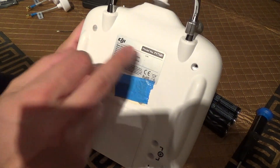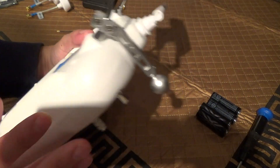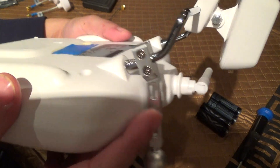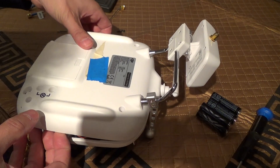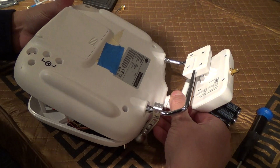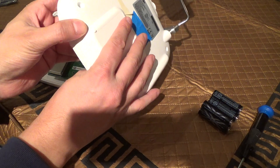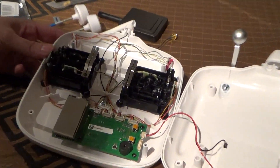To open the controller, you have to undo 4 Phillips screws — that's it. Then you lift the back cover at a slight angle, getting it off of the antenna loop. Don't worry about this antenna loop; it holds the top part of the controller together and is flexible, so don't worry about it flexing a bit as you try to take the unit apart. Be careful of the power lead underneath, which goes through the battery box. And here you have the internals of your controller.